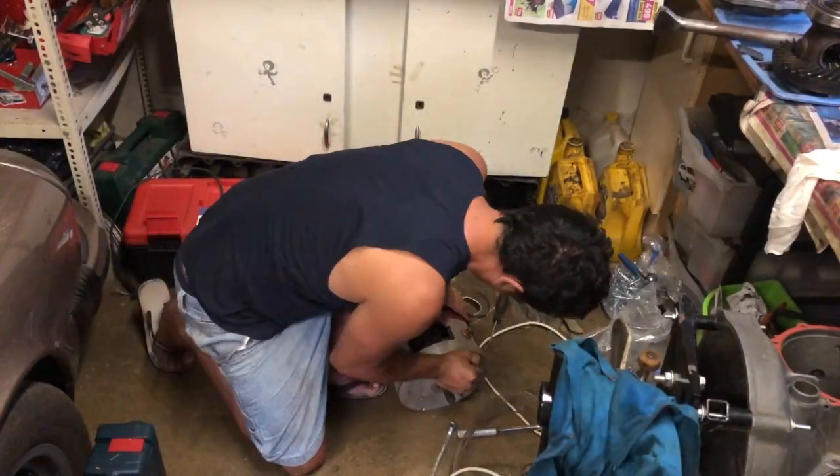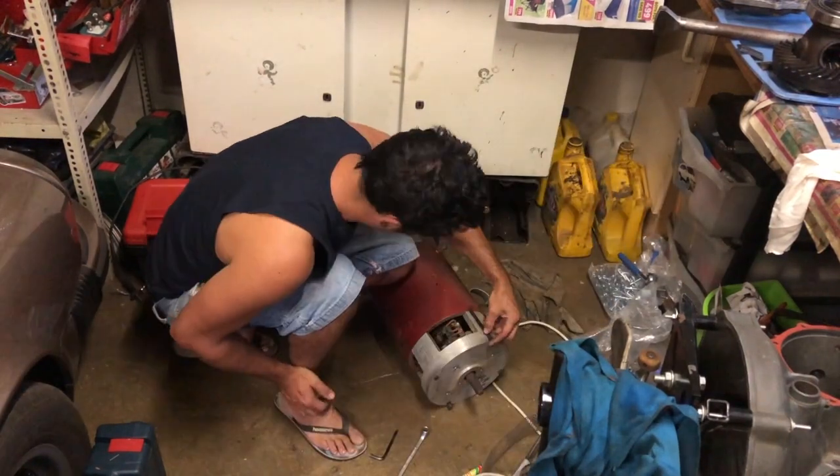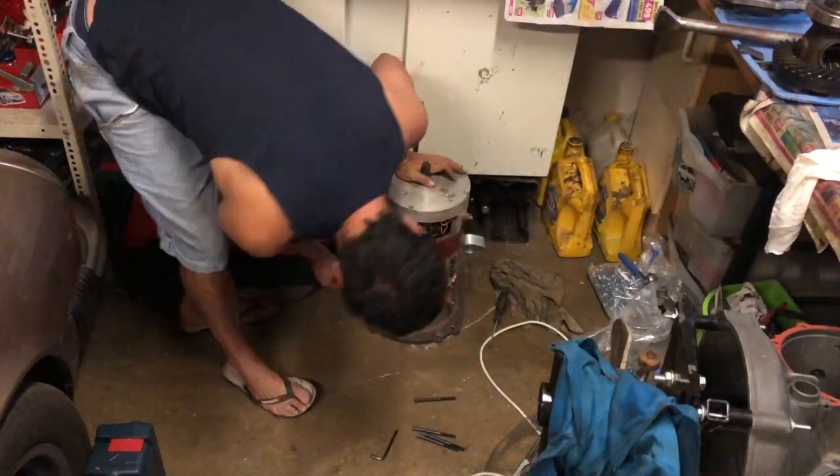Step one is to check that your brushes are not melted onto the thing. Okay, so I don't know if you saw that. The top bearing — so I guess that's the back of the motor — that's turning, so that's fine. The bearing also turned, so maybe the inside has expanded against the outer windings. Inner windings against outer windings.